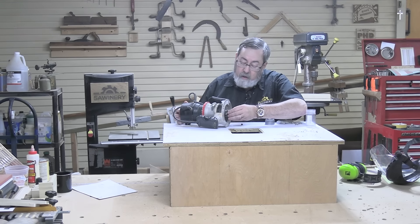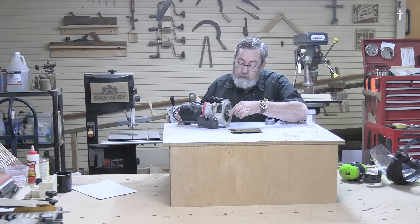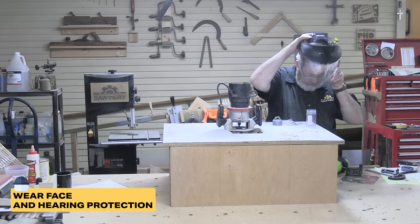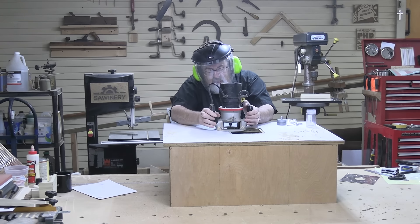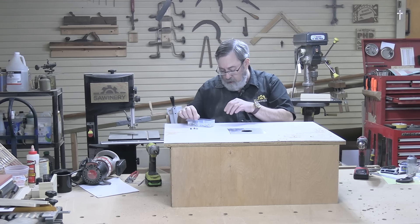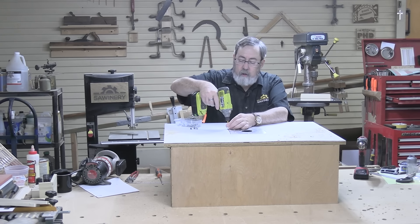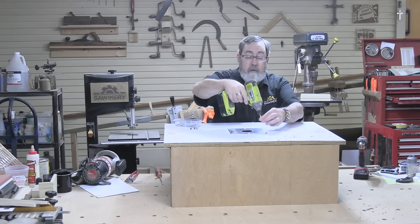My adhesive has had plenty of time to dry, so I'm ready to go ahead and trim it. To do that, I'm using a trim router with a laminate trimming bit in it. This is a fairly simple operation — we just want to be careful that we don't let the router wobble in the process. I've gone ahead and cut out a square through the top of the router table to inset the mounting panel for the router. Now I need this to sit flush, so I'm going to use a rabbeting bit in a router to cut a shoulder — a rabbet — for that to sit into.